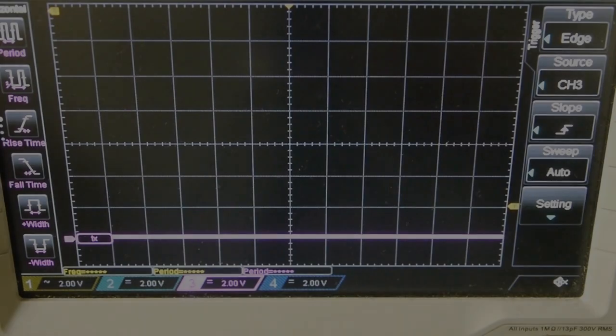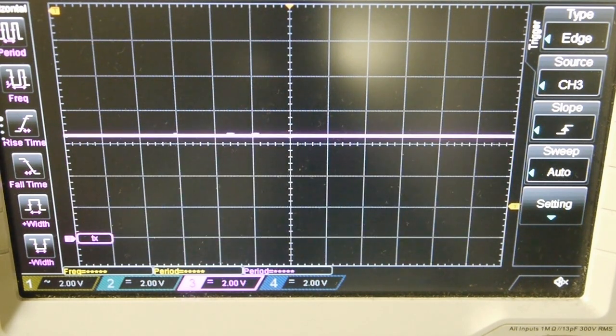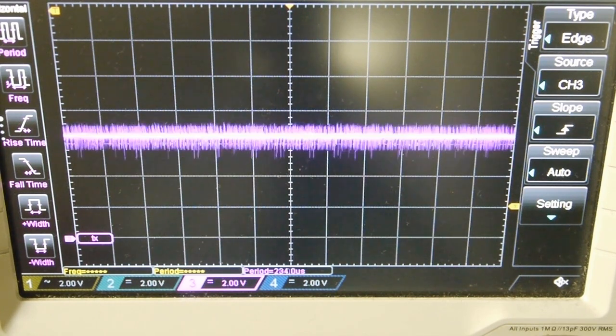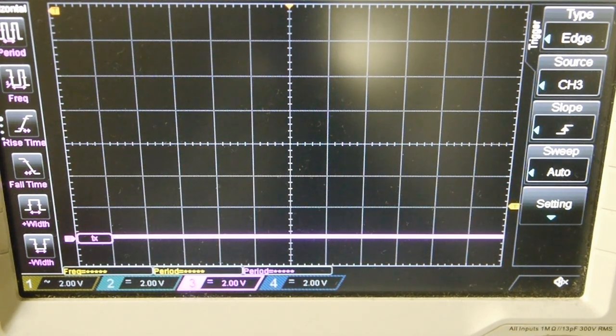Okay, so we're on the scope, and fortunately there's some legends on here so I can actually see what the signals are. So if I turn this 41C on, I don't know if you can hear that, but it actually beeps every time I press a key, not really sure why. So we've got clock 1, clock 2, sync, ISA, data, FI, there's just a bit of noise there, no signal, PWO, and then you've got the B3, B4, they're actually 0 on this slot. VBAT I don't have anything on, and I'm not really sure why not. Maybe it doesn't actually come out to the slots I thought it did. And that's V, which is battery voltage, and then ground, which is going to be nothing. So that seems to work.